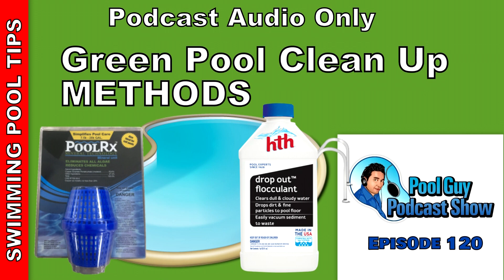If you do green pool cleanup as a living, you definitely want to invest in a portable filtration system like the Advantage PortaVac or Minivac 2 — these are pre-built standalone filtration systems you can use for green pool cleanups. You can also build a portable green pool cleanup pump for about $250. Just be realistic when using one of these pumps — whenever you're vacuuming a pool that has a lot of algae dust on the bottom, it's going to stir it up. It's not going to be clean blue streaks; it may actually make the pool a little cloudy or green again. It may take two or three vacuuming sessions to get all the dust out.